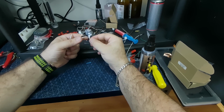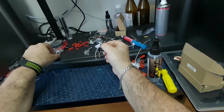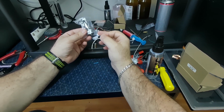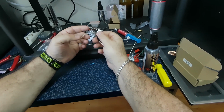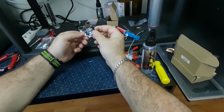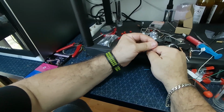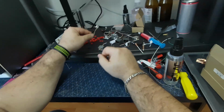And then when you get this out, you can transfer it to these hot ends that are virtually the same as the original one, but they have the wrong thermistor here. Of course, you can try to also transfer only the thermistor, but there is a very big chance that you break these legs here. So if you transfer anything, transfer the entire thing, not just the thermistor.